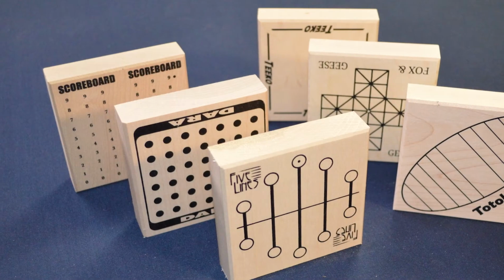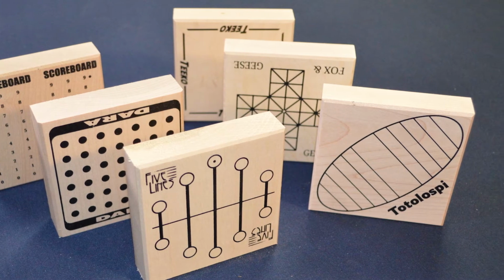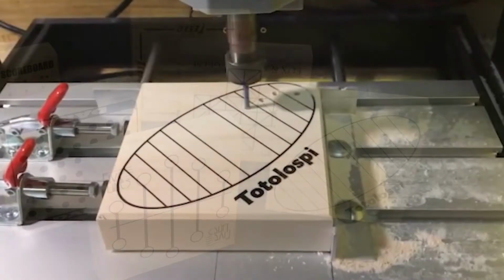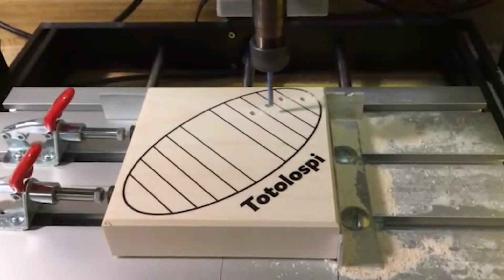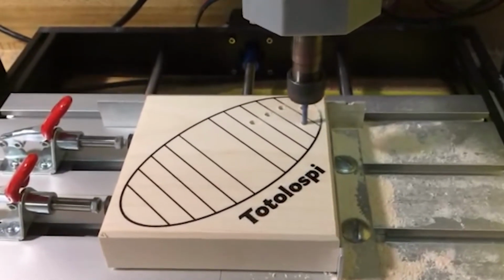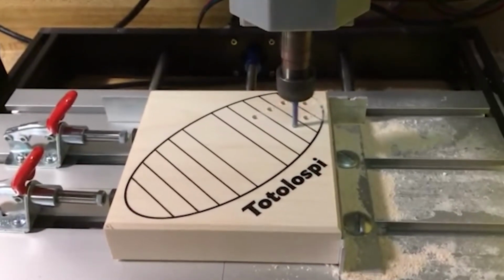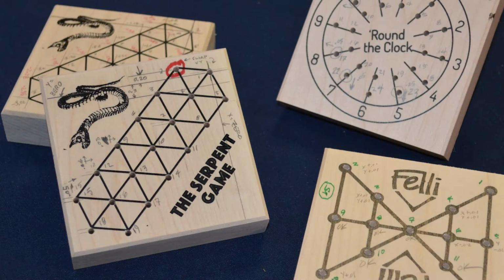The silk screening is designed for the artwork there, and that gets applied to these board blanks. And then we create a drill path for the CNC machine. That takes a little bit of tweaking on these things sometimes. There's variance in the silk screen, but we want things to line up as good as possible to make sure the geometry fits the board properly.